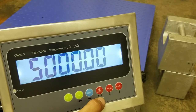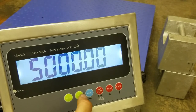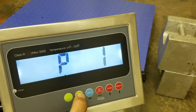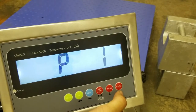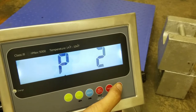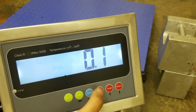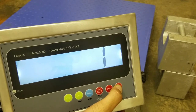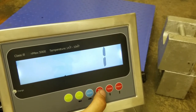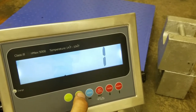There's also a set button at the bottom. You'll go back with unit and you will go to P1. From here you will go up to P2 with the print option. Press 0 to enter and it will give you 0.1, 0.2, 0.5, and 1 pound increments. We're going to set it on 1 pound. Press net/gross to save, and press unit to go back.